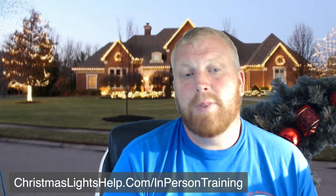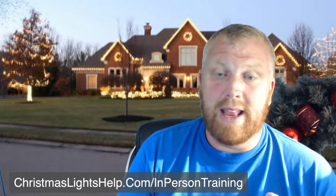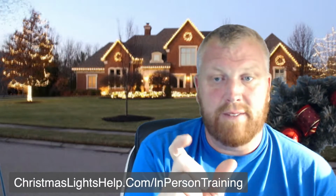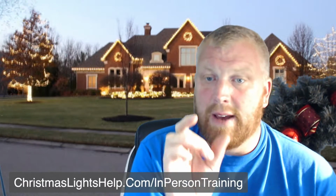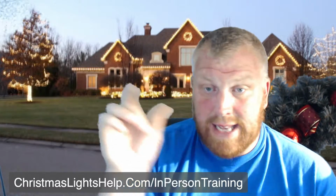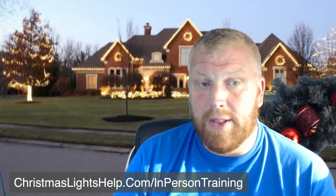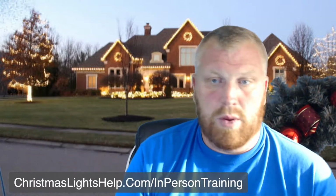These trees right here, this tree over here, all these bushes right across here, the old incandescent bushes, you could only run 5 strands of incandescent lights plugged together, because if you did more than that, it would pop the fuse in the very first one, and that fuse was rated at 2.5 amps. So every time we got to 10 amps, we'd have to find another circuit. So we wouldn't have been able to do what we did here.